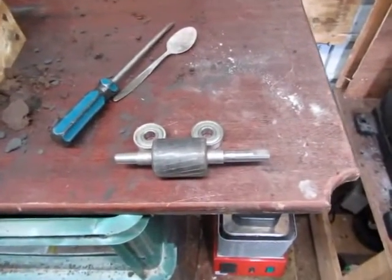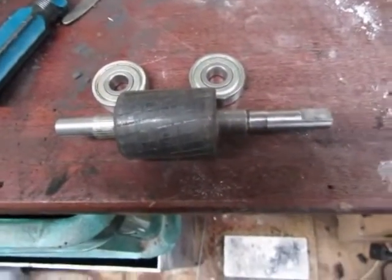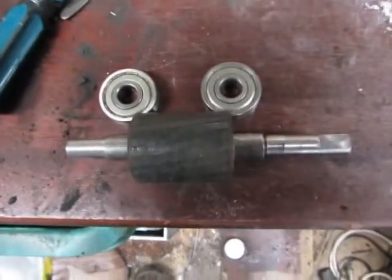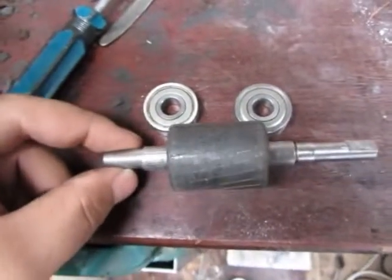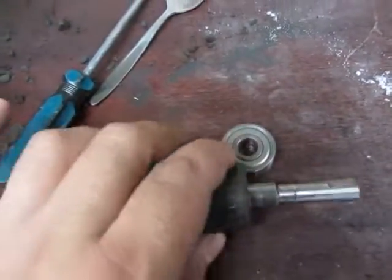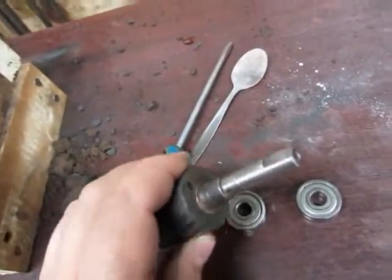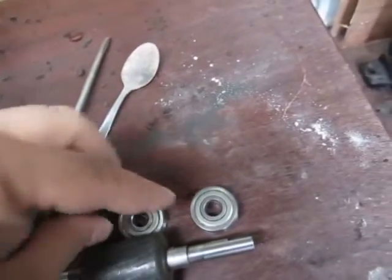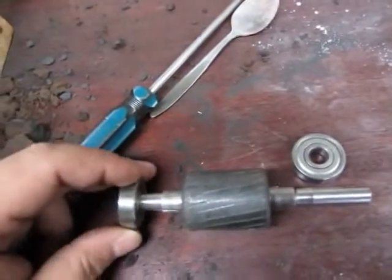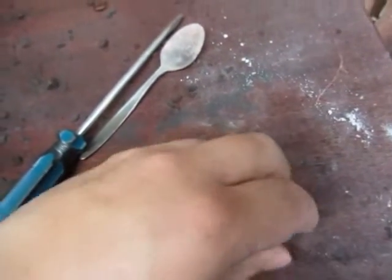This is just a supplement to the existing video. The motor shaft has been pressed and taken out of the press. You can see the back end and this will be the drive end. On this side you can see it's got a flat on it to drive a pulley, or whatever — a grub screw will fit onto there. The next stage will be to press on two bearings, front and back.